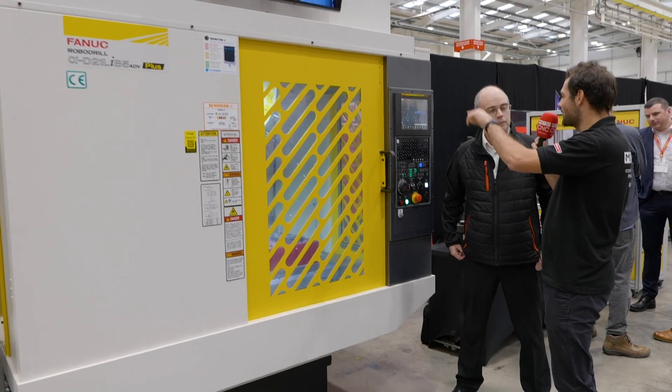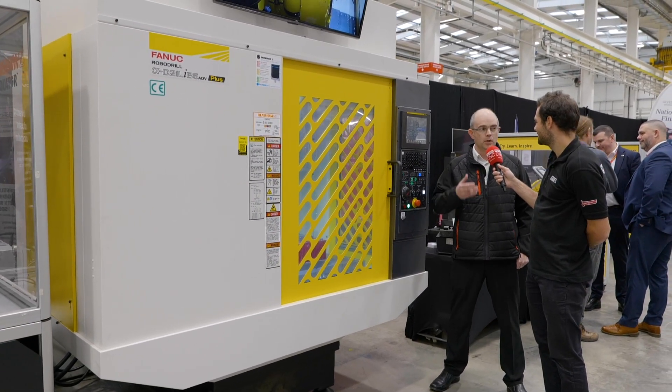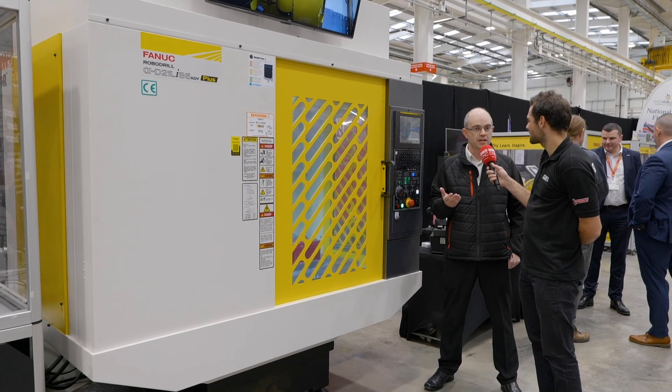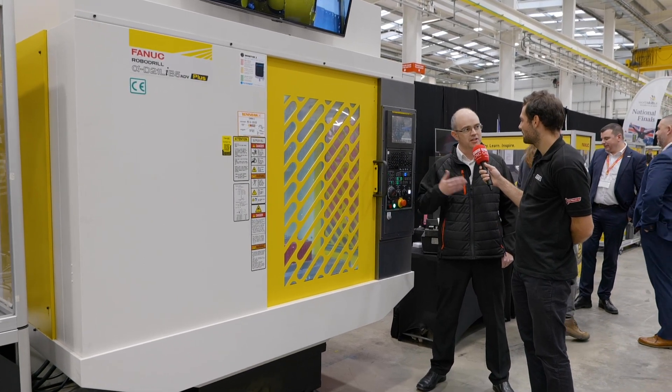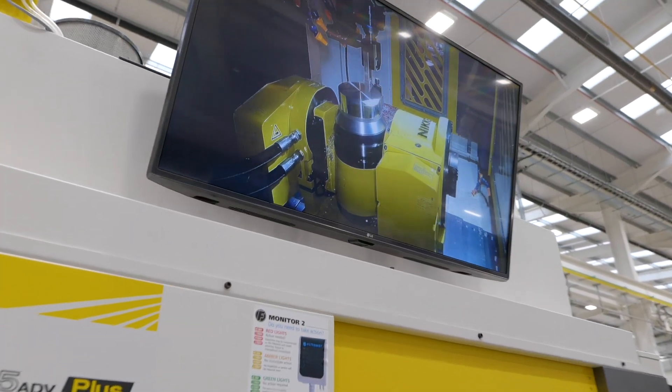You can draw that profile rough finish — draw your profile and cut in coordinates as you would do on any other CNC lathe: G71, G72, G70, they're all there. Constant surface speed — all those functions are now available on the RoboDrill.